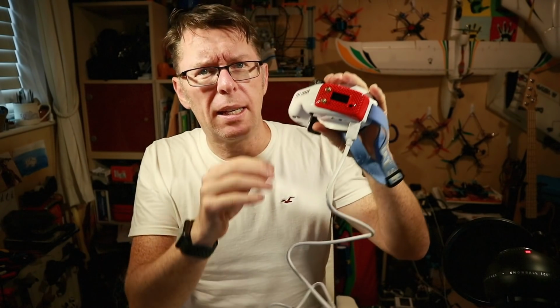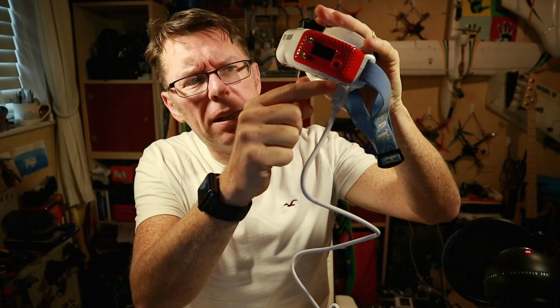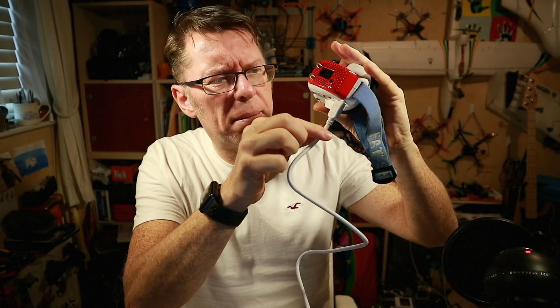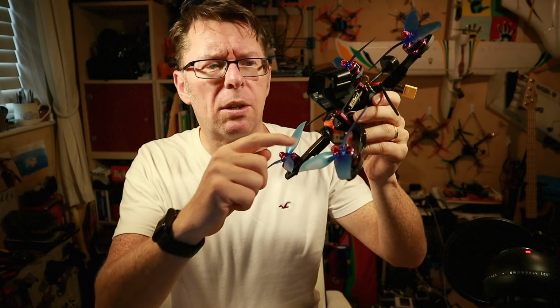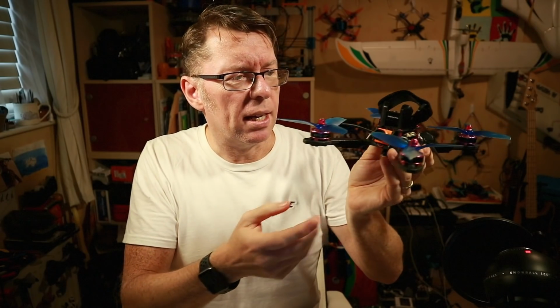So just to explain what happened in that crash, what I think happened is, if you see we've got this HDMI cable in the FatShark set, there is just a little bit of a loose, either a loose socket or a loose connector here, but having retested, that cable's pretty dodgy anyway, so although I didn't pull against anything, just the slightest movement seemed to have caused an electrical contact to fail, and basically all picture is lost. Me wiggling it around just got it back, and then I had to disarm. Fortunately here's the quad, and you can probably see just that little dirt there, it seemed to have come down there. Nice big long wet grass. The actual unit's fine. I was just worried that it was going to hit that stream.